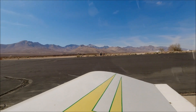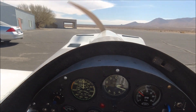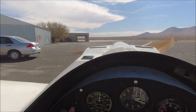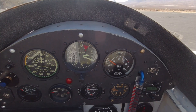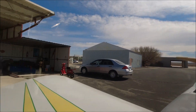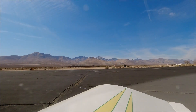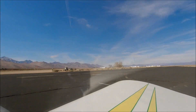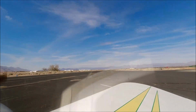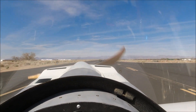Another objective for today's flight is to do a couple of speed triangles to verify a new static system on the airplane. In addition to the static port on the left side of the fuselage that I've used for all my flights so far, my buddy and I installed a piccolo tube on the right side of the fuselage in roughly the same longitudinal position as the existing static port. I then cross-plumbed that into the existing static system to try to reduce some error. We'll go up and see if the airspeed and altimeter needles swing as much as they did before, and hopefully correlate indicated airspeed to true airspeed and ground speed to figure out where my static error is.